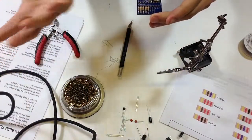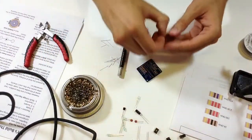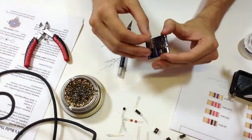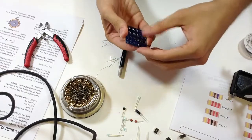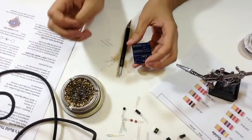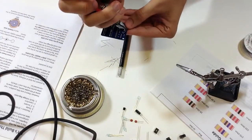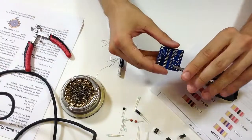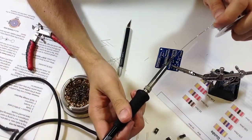There are no connection problems — it's all digital. Next is the diode, the small little diode. It goes right beneath the 6N138; slide it in and push the leads away from the IC. The diode is heat sensitive, so don't spend all day there.